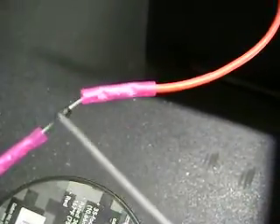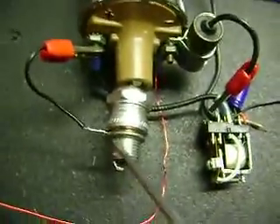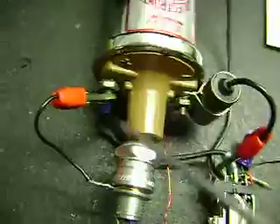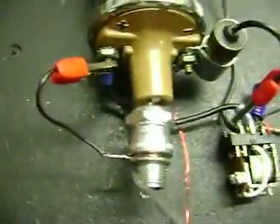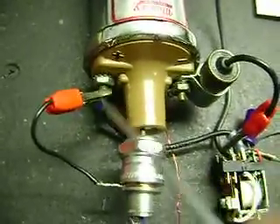Here we have the large inductor. The diode is forward conducting with the cathode here, and we can see it's positive. The switch is already on. Then we have the negative that comes down to the same terminal on the relay — the normally open contact — and from the armature comes down to this side. I got the ground for the spark plug; I can put it just about anywhere to the battery, wherever I want, and I'm going to get a good spark. I'll put it there because it's easier and I want to be able to take it off later in this video.